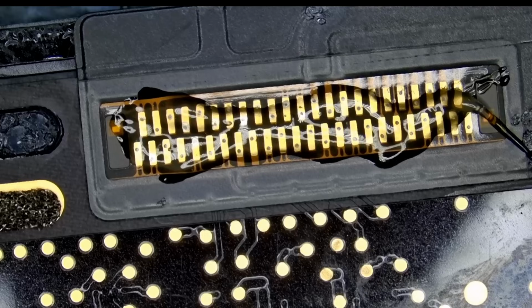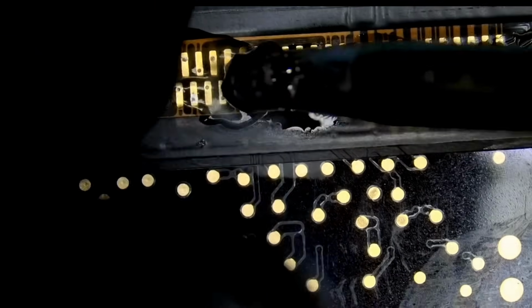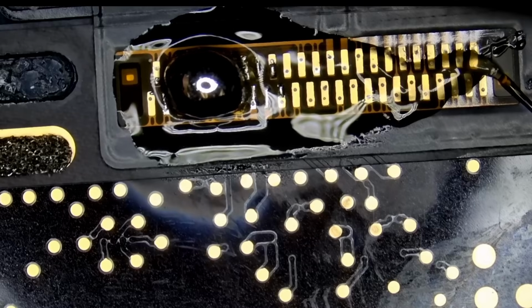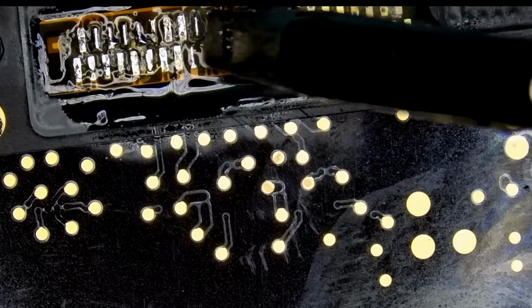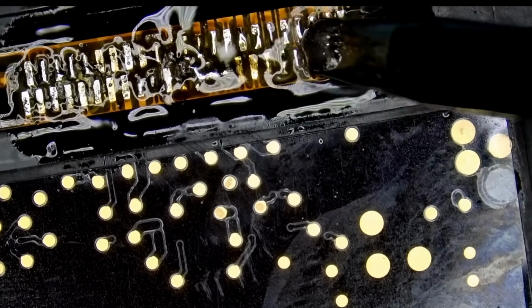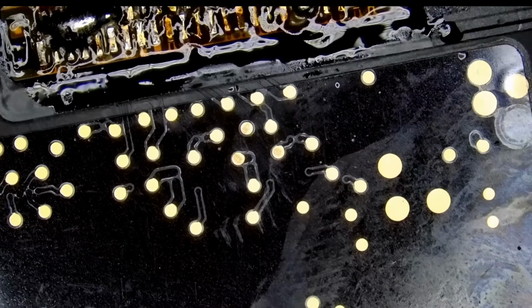We're going to use low melt solder. The reason I want to use low melt solder is so that we can remove the flex cable without ripping any pads. That's the safe way of doing it. All right. So let's take this whole piece. We do not need that much low melt solder, but the piece is already small, so I'm not going to use half of a small piece. I just use the whole thing. So we're going to soak those pads with low melt solder. Tap, tap, tap. And you'll see, look at this. You can already tell that the cable is coming out. We did not even apply hot air.